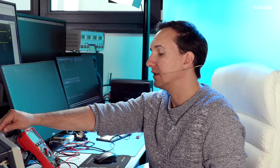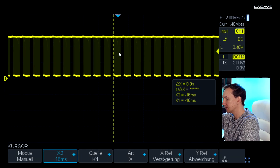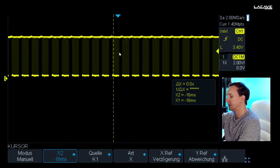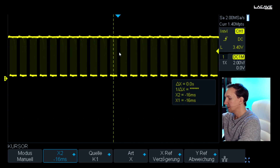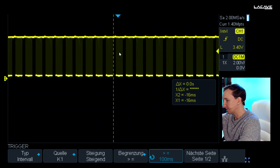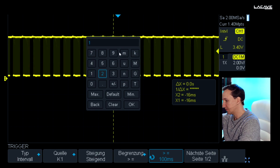The specification says 88 microseconds and we have measured 180 microseconds, so that's fine. Now let's set the trigger point correctly for the oscilloscope. I'm going to choose 120 microseconds because the GrandMA is still sending a longer interval than we need to define and identify the starting point. So let's set the trigger to interval with 120 microseconds.